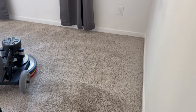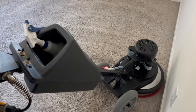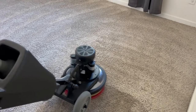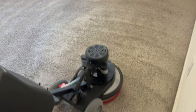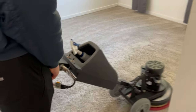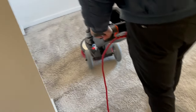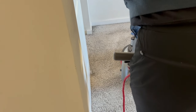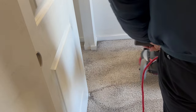If they have just one room of carpet and the rest of the house is wood or tile, we'll allow somebody to mix and match — another room, a kitchen and a hallway, or even a bathroom in place of a hallway if it's tile or wood. We pretty much clean everything with the same solutions, so that doesn't cause any added work. For wood I'll use a microfiber pad or a two-way pad — it looks like an Iron Man pad but it's actually a polyester material, so it glides a little easier, spins a little faster, and has no risk of leaving swirls behind on the wood.